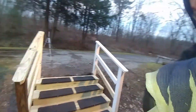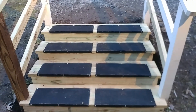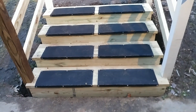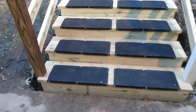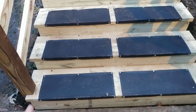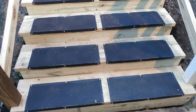I'm really glad we took out those old concrete steps. The first step was like three or four inches, then the next one was like seven, then the one after was like nine — all the steps were a different height. These new ones should be exactly the same, pretty much exactly how they should be. We also added rubber mats — they were in the carpet section of Home Depot. They look pretty good and we've got them screwed down. I wanted to screw them down instead of using liquid nails, just for the simple fact that if we ever wanted to take them up, we can. They're easily removable and the screws should hold just fine in cold temperatures.